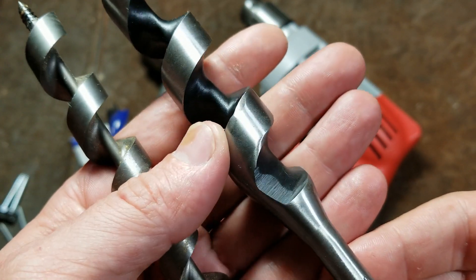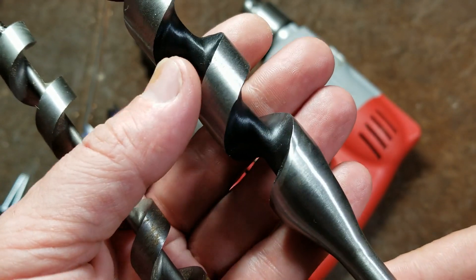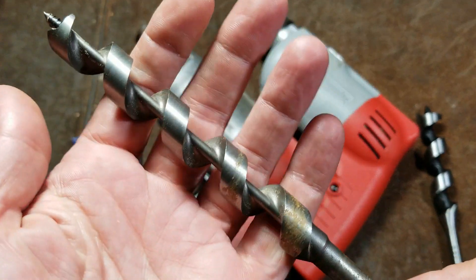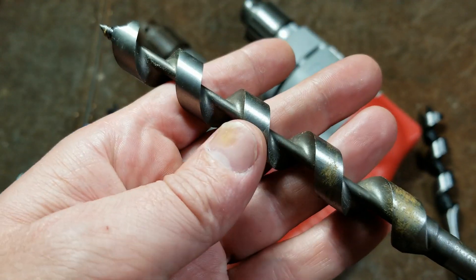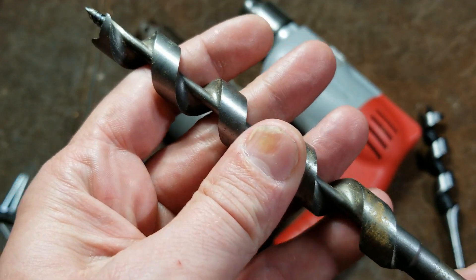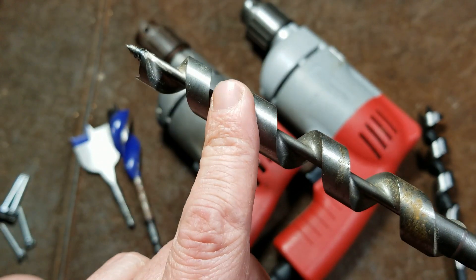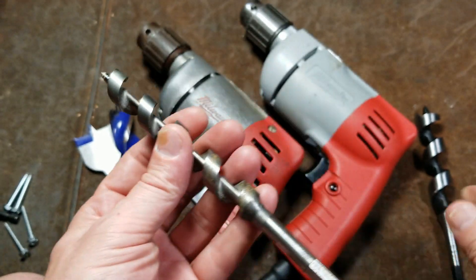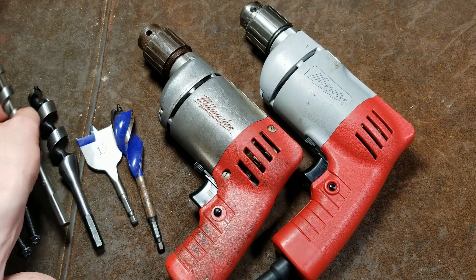These things are just horrid. This is an old American-made Irwin and this thing is machined — just beautiful, nice real even center rod. Center rods give you a little bit more rigidity. And it's hollow-ground, which means they had to do two grinding operations, one going this way and one going back the other way. So the Irwin brand has just totally gone down the tubes.